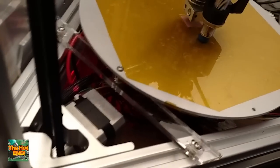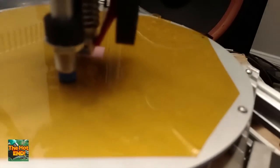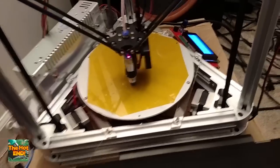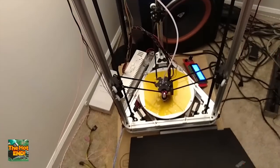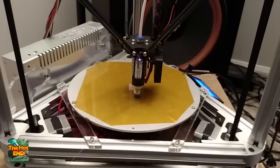It's just chucking right along there, which is really cool. So far, the layer height is really well done. It's due to a Z-probe configuration in the firmware. The M212 command and all the other commands that are soft programmable do not seem to work very well — probably just due to RAMPS itself or my ignorance. I've tried a couple of commands; some of them don't seem to work.